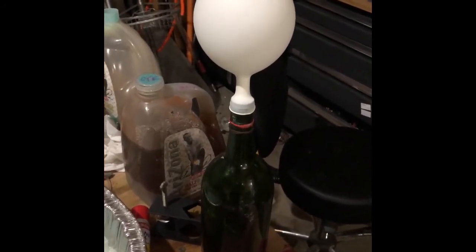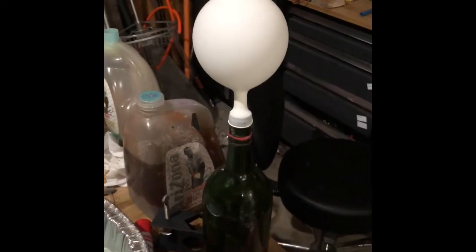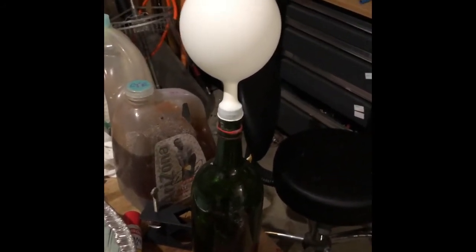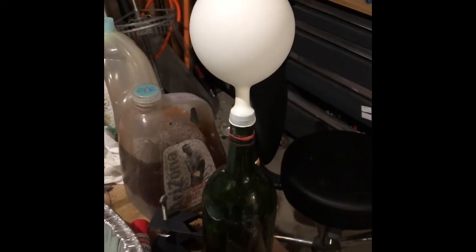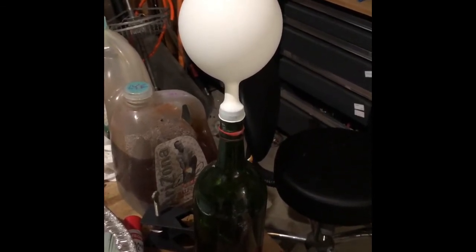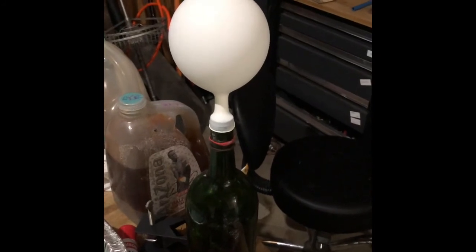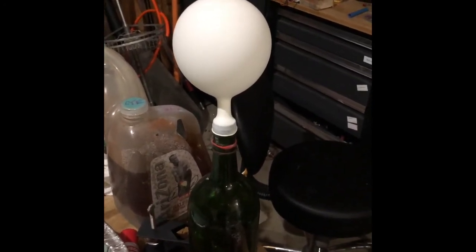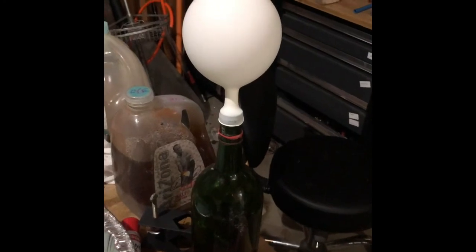Good news. That's a pretty good sized balloon, especially since these balloons are supposedly of higher strength than the previous average everyday balloons, so there's more tension working against the hydrogen pressure — which means there must be adequate pressure to fill this up. Now what I've got to do is get my lid on there, get the on/off ability, and get this gas going into something to utilize the capabilities of the hydrogen, such as running a generator or causing a catalytic converter to heat up and act as a heater. These are various tests I plan on doing. So stay tuned to the Reckless Retiree.